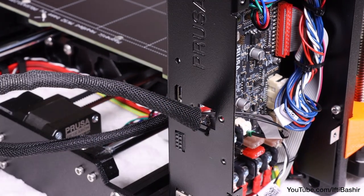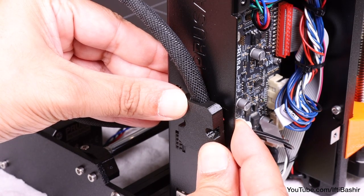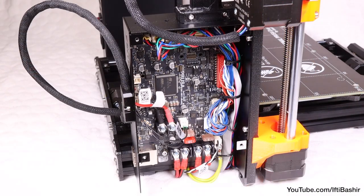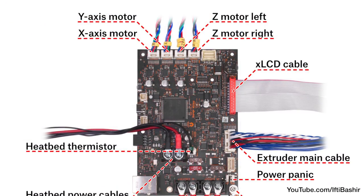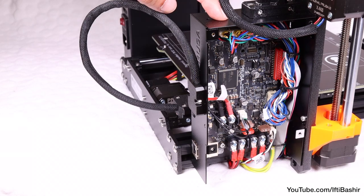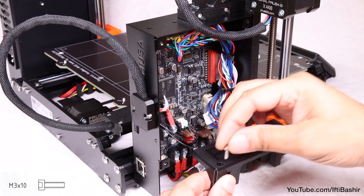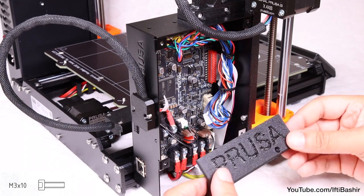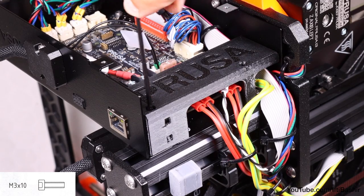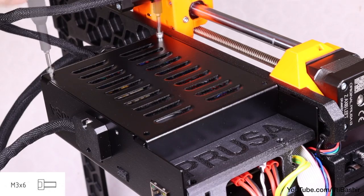Time to neaten and finish up with the board now — proceed to install the single 3D printed cable holder to the rear side of the chassis just here, covering the heat bed cable opening. Note that the heat bed cable bundle should be facing upwards. Tighten firmly with two M3 by 6 screws. Before we seal up the electronics board, double check all connections carefully using the diagram displayed here. It's very important that all the power cables are correctly orientated, checking all motor connections too, as well as ensuring all screws are tight. Once verified, we can begin to seal the box, starting with the lower 3D printed cover. Push two M3 by 10 screws through the available holes and line up with the two available threaded holes in the electronics box, taking care to ensure there is no other cable in the way. Secure the cover by tightening both M3 by 10 screws until snug. Finally, align the metal cover over the chassis and secure with four M3 by 6 screws.